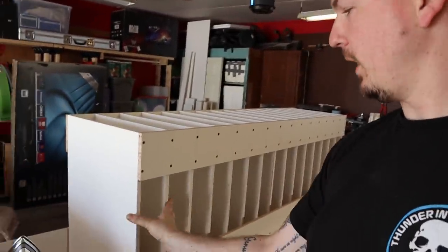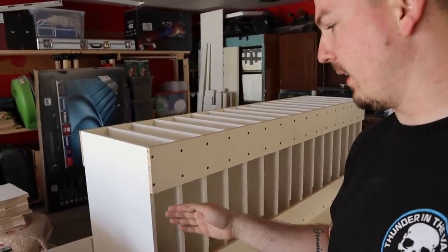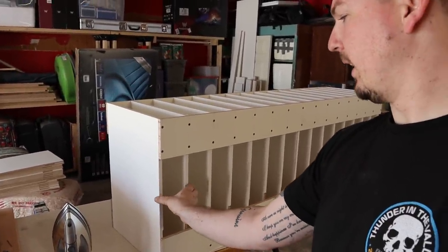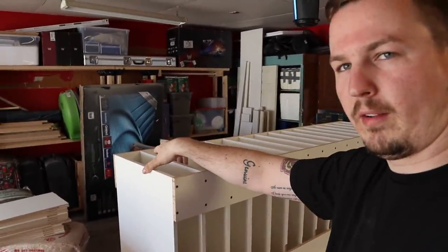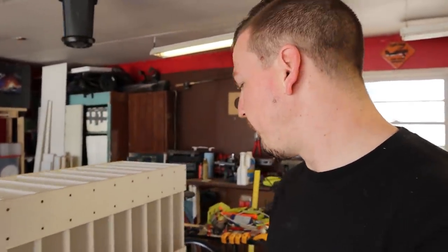And I just clamped it here instead of in the top, because that way it kind of clamps top and bottom, and any little bit of flex that I put in the shelf by clamping it here would release, whereas if I squeeze this too tight and you screw it, it's gonna be stuck. So just a little tip.